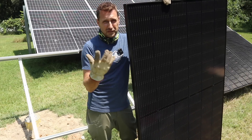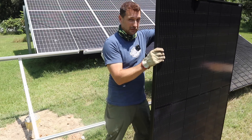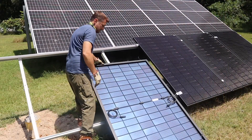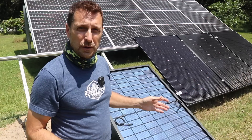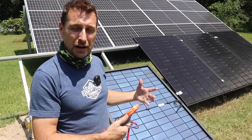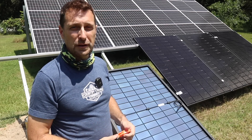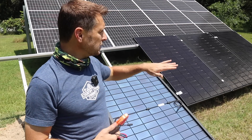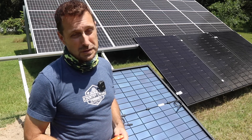Now I'm going to flip one of these panels over in this bright sunlight and see what it produces. When handling these panels in the sun, use gloves because that black really absorbs the heat fast. If you flip these over, you're going to get about the same voltage - I've got about 32.7 volts on the back. If we flip the panel back over without a reflective surface underneath, we won't get that same voltage and subsequently the same wattage. But with a white covering on the ground, you'll be able to maximize that bifacial gain as much as you possibly can.